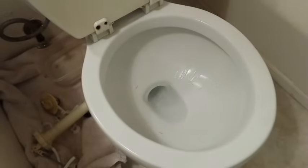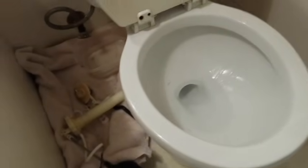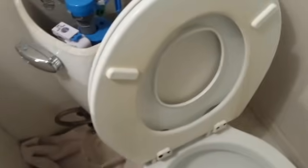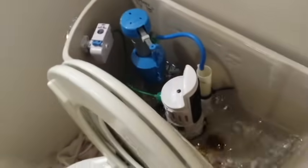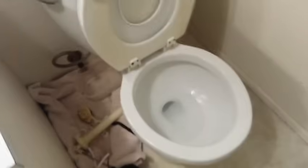After studying the instructions and making adjustments, I finally got it dialed in. You go back and forth between the auxiliary fill valve and the quick flush adjustment — the blue one — to get it to flush correctly, fill back to the line, and stop without rippling. Rippling means the auxiliary fill valve is dumping water in late, which you don't want. As you close that valve it doesn't flush as well, so you keep clicking the blue flush valve adjustment down until you find a balance. I also adjusted the green full-flush clicker up a little to reduce water usage on full flush.